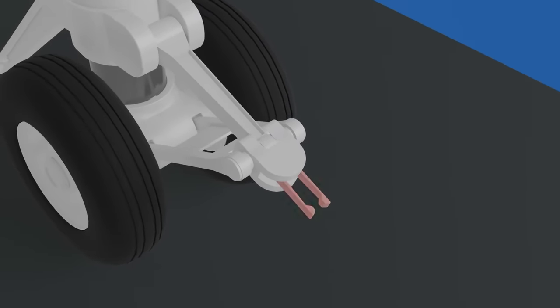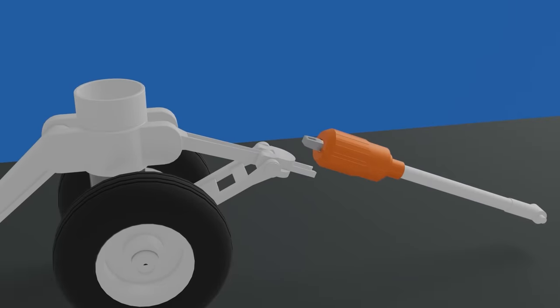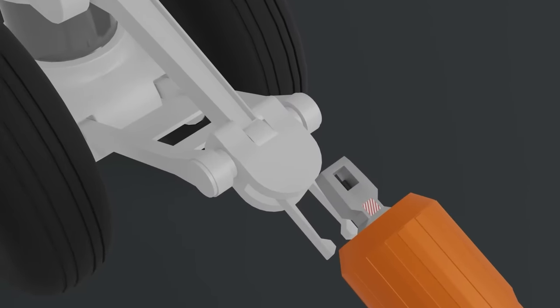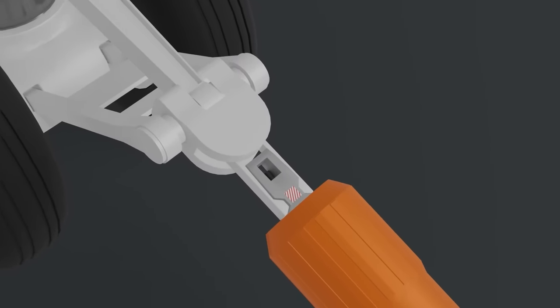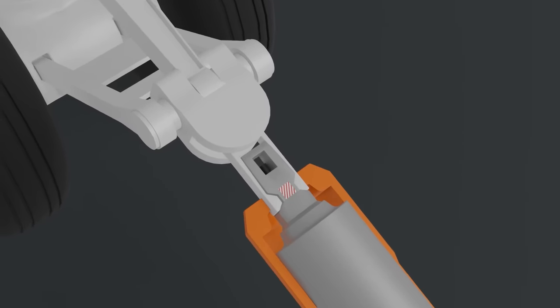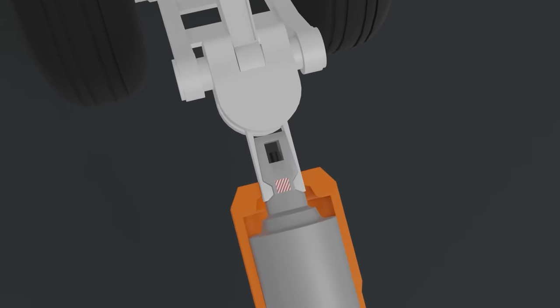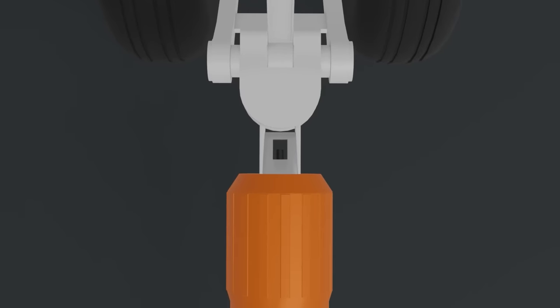There's a finger-like link on the front landing gear of the aircraft. The holdback operator in a green shirt slides the housing back, revealing the tongue with chamfered notches, and places the holdback right into the link. Then he slides the housing forward, securing the connection, and verifies that the housing is fully covering the candy-striped area. Now the holdback is locked to the link just like a jigsaw puzzle.